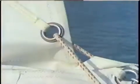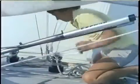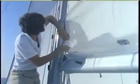Shaking out the reef, especially with a slotted luff, can cause some problems. Outward tension on the foot can pull the luff away from the spar when the sail is being hoisted, so free up the reef clew line first, and be sure that the vang and even the flattening reef are eased as well. Then hoist the halyard. The halyard man must watch the luff feeder to avoid damaging the luff tape or jamming it in the groove.